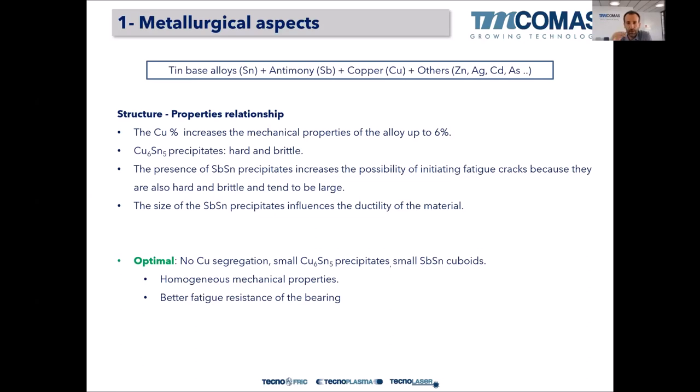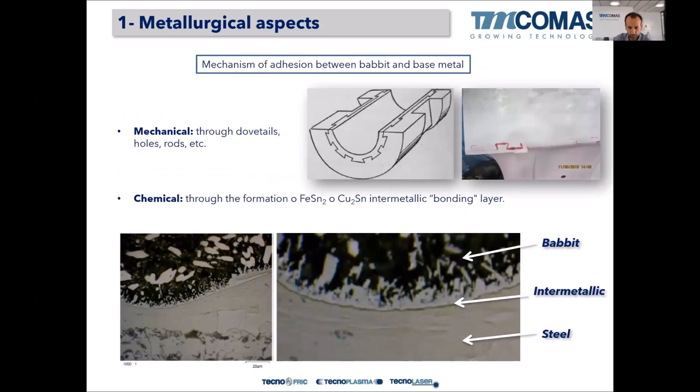In those machines where the bearings are of quite nice design and everything runs smoothly and there is no oil leak and nothing happens, a fatigue failure will appear in the bearing at the end because the load is a cyclical load. In the rotors, sometimes there is some overloading and some cycling. So in the end, the fatigue appears, and the finer and smoother the structure is, the later the fatigue will appear, right?